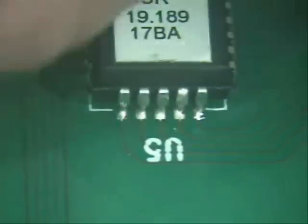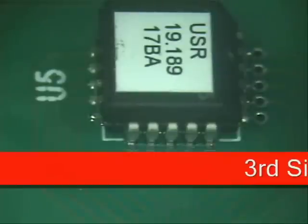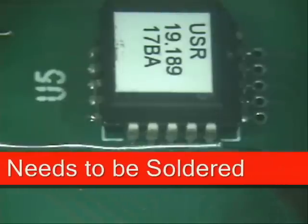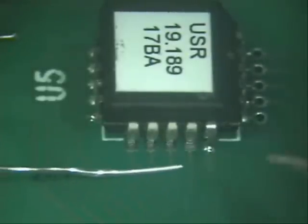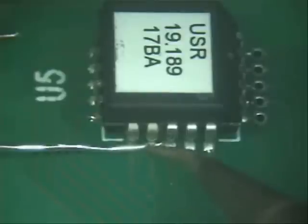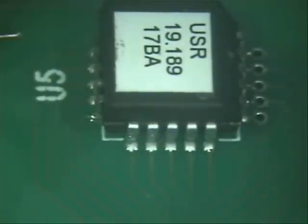Next, go to another side. Clean off your tip very well, flux up the area where you're going to solder. Lay your lead-free solder into place just like so, going past that leg a little bit. See the solder flow come up just like that — slide it in to the next one, and the next one. You'll notice I'm getting wetting action all the way up, indicating solder flow to the back area, creating a nice heel fillet on the back side also.